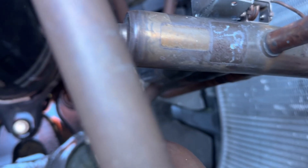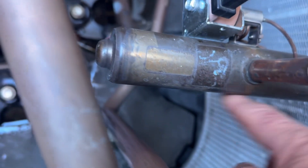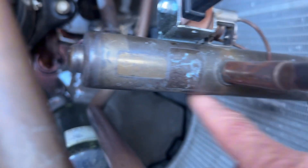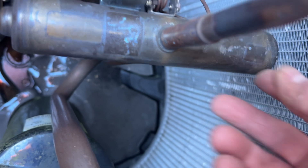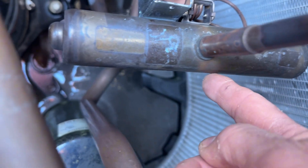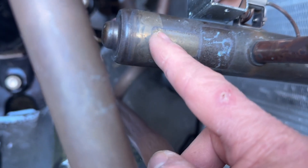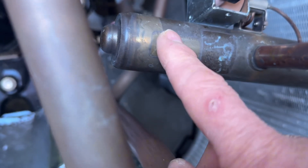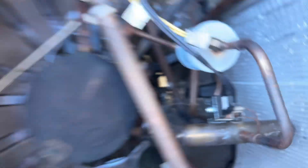Come down here on the side of the tube — mine has connections going off the top so I can't access there. What I did to fix this very heat pump: I took a magnet and went back and forth along the tube, about 30 to 40 times. The metal valve inside will adhere to that magnetic field, and as you slide the magnet along the copper tube, the valve slides along with it, loosening it up. That should fix your problem.